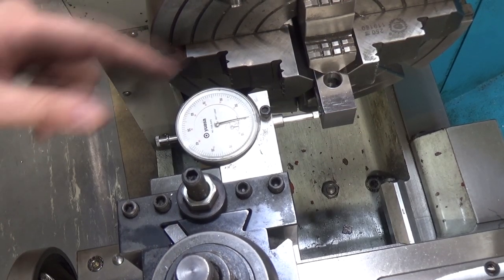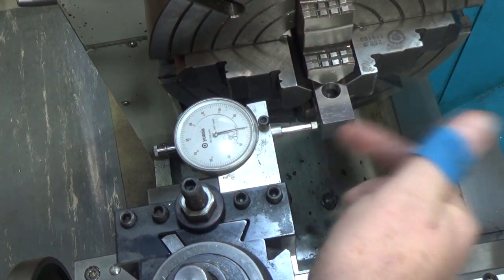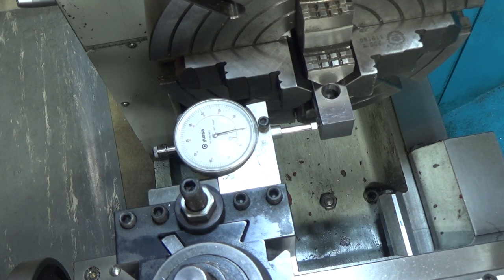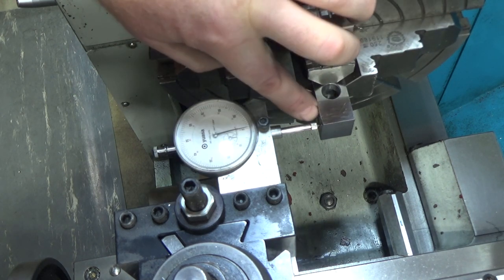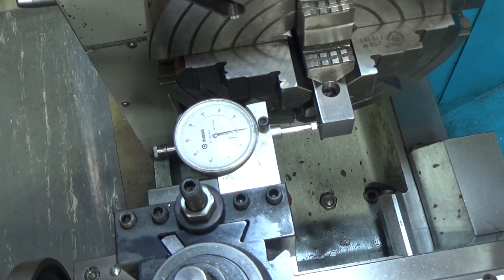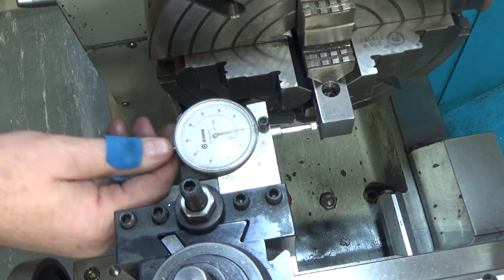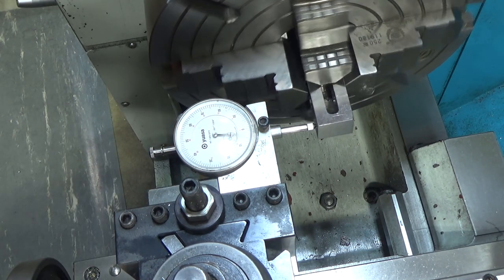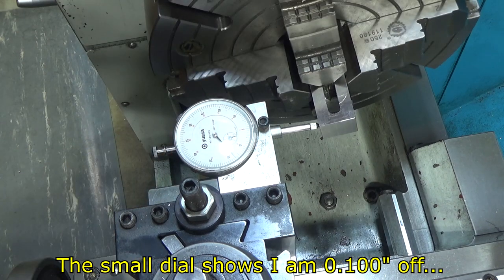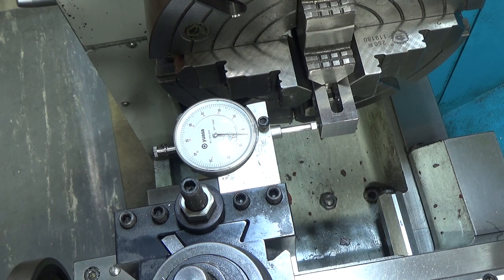All right, so set up a quadrilateral target inside a four jaw chuck, but then set it up so it's centered. Can be a bit of a challenge, but it's not too tricky. So what you do is you look for the low point on one side and then set a zero and then make the low point on the opposite side match. Now this is 9/10 in one direction and 1 inch in another direction, so it'll be a little bit off. But you find the low point in one side, that's a tenth over, which is good because it's about a tenth. It's a little over a tenth actually, and make the other side match. And that's pretty much it.